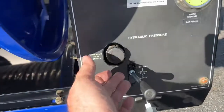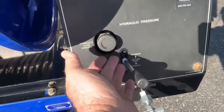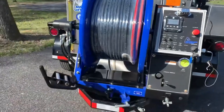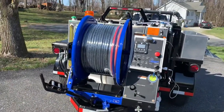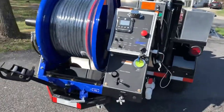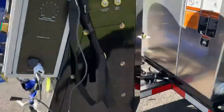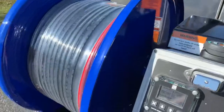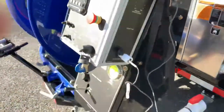Operating here at the control panel, you also have control of your hose reel pay-in and pay-out with the joystick, plus flow control to adjust the speed of the hose reel — from almost a standstill up to faster than you'll ever need. It also has a hydraulic bypass so you can freewheel the reel and pull off a few feet of hose without having to start your jetter.